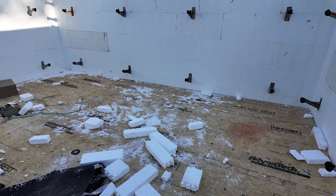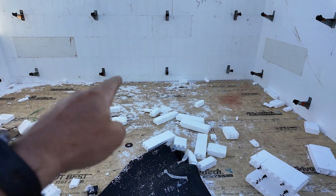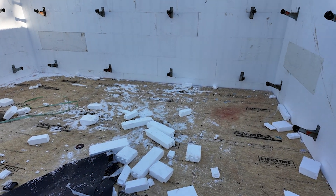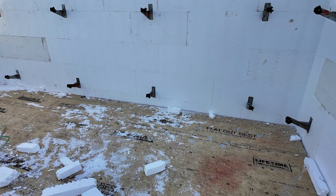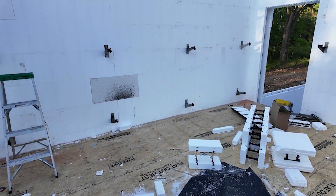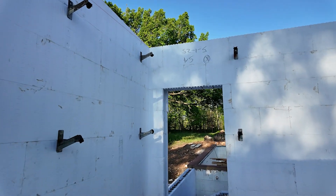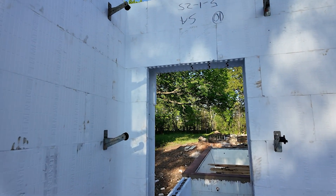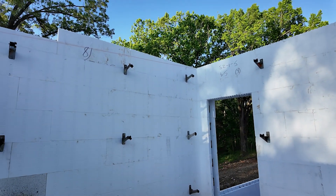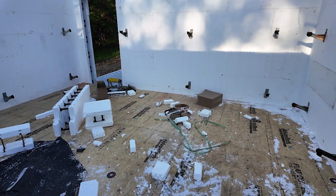We took every screw out, so this floor is just completely loose. We have a couple pneumatic jacks we use to level floors when we're working on old houses, and we put one under each end. The rim joists are running this way, so we put one under here and one on the other side. And in unison, we just lifted the thing up nine inches. It took a couple hours — it was actually remarkably smooth. But it did kind of set us back. We would have easily had all the bracing done today, and now we still have to put all the bracing up. We have a bonding inspection here in a little bit on the retaining wall portion out here, because it's within five feet of the pool. We pour this here in about four hours.